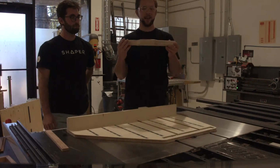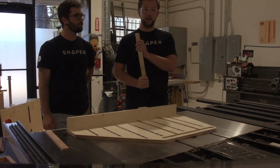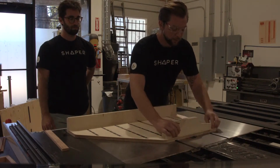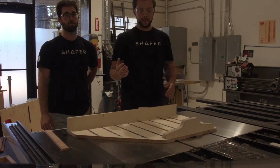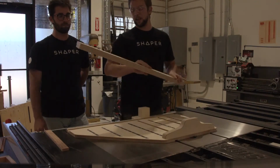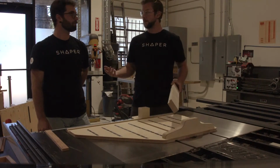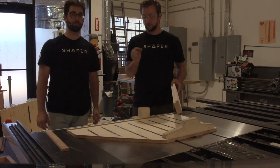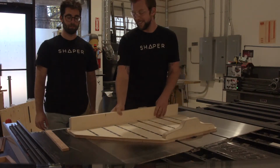We're just taking that ply and doubling up on it. And with a 1/4-inch roundover bit on a trim router, it matches up to the mortise for that front handle perfectly. Allows you to get the fit really, really nice. And same thing with the fence back here. Double up ply. Now, something to note as well, everyone's plywood is a different thickness. Even the same type of plywood on a different day is a different thickness, ever so slightly. But remember, we're using Origin, so that ever so slight difference matters.